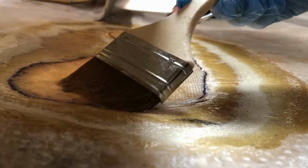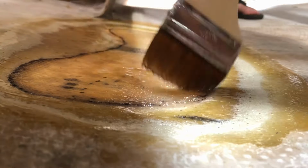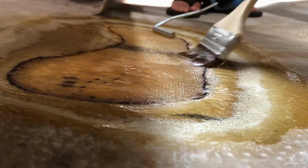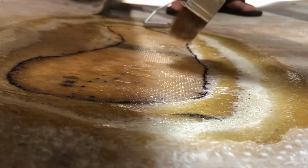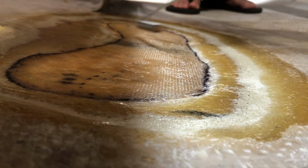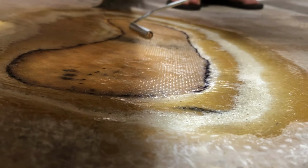Bubble busting is another crucial step in ensuring the fiberglass application is free from trapped air, which can lead to delamination or a weak bond overall. Properly eliminating air bubbles enhances the integrity of the laminate and ensures a high quality finish.